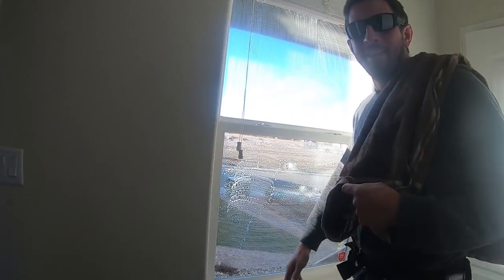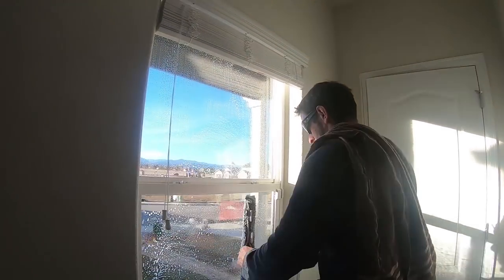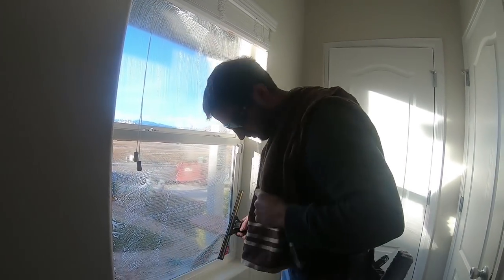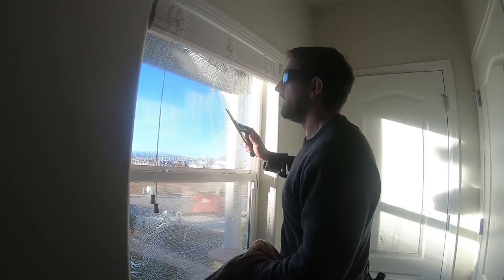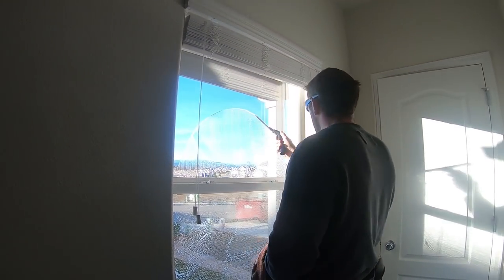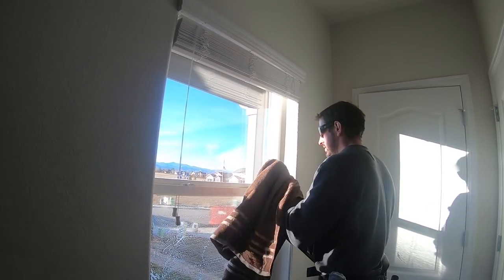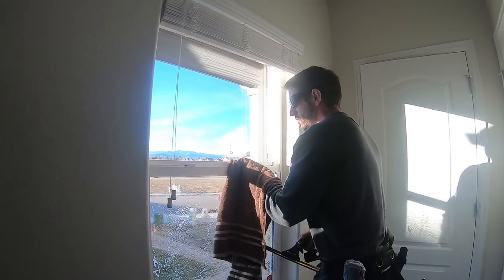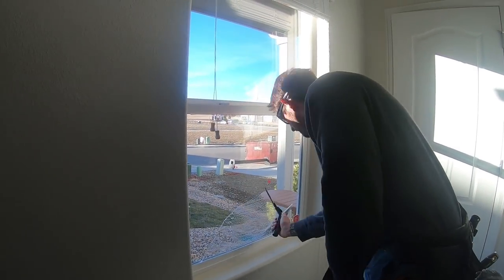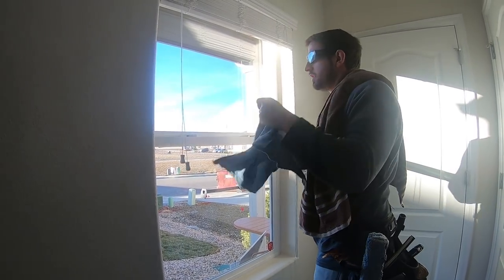If you forgot your squeegee, you can come back and re-wet the window. Be careful — you're always catching your drips. Inside the house, use a drop cloth. Squeegee the top first. Usually you can do both panes at one time without cleaning the middle area, but some double hung windows have a slant there and you'll get drips if you don't do that part in between. Just get the majority of the large water up there, clean it off, clean off that ledge, and detail the glass.